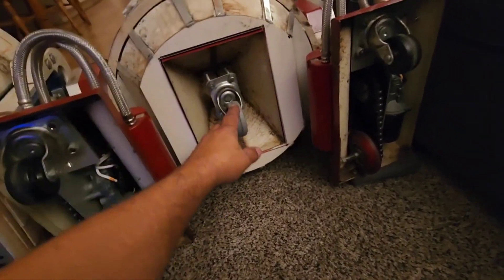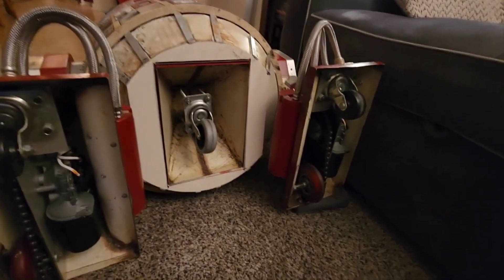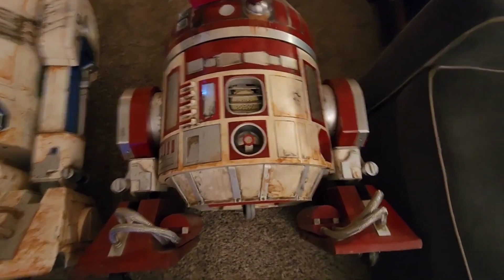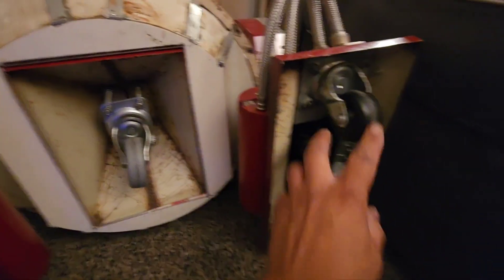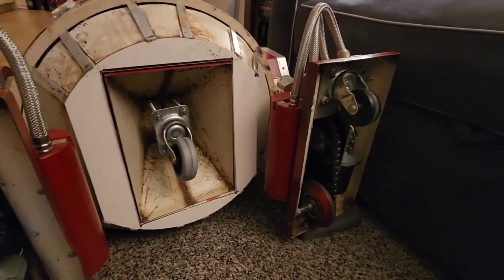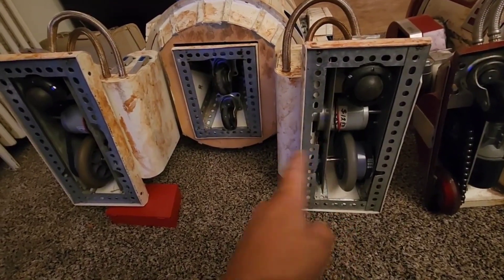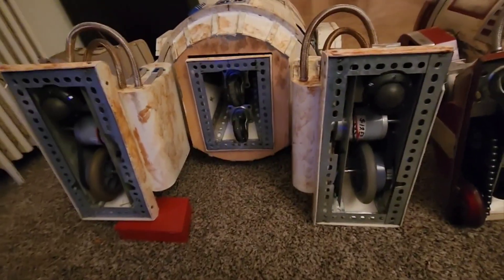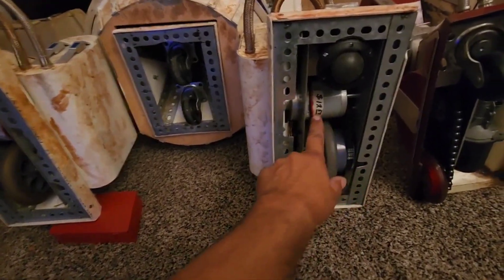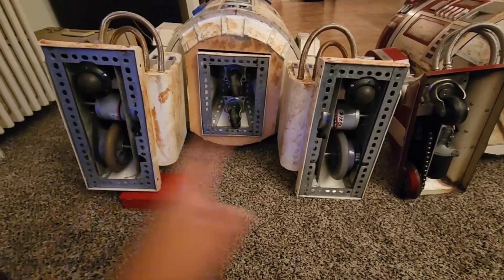This middle foot is a fixed ankle, that's why I just have one caster in here. I didn't even think about wheelbase on this — on the Mini he's very small, and the wheelbase from the caster to the drive wheel was roughly 8¾ to 9 inches, which is a pretty good wheelbase. Then we move on to the full-size droids where people were running the scooter motors. By the time I refurbished this one, the Razor scooter parts were available as surplus replacement parts online, relatively cheap. As you can see by the price sticker still on there, I paid $12.50 for this at American Science and Surplus, and I got two of them — and these are mirror images that run the same speed forward and backwards.